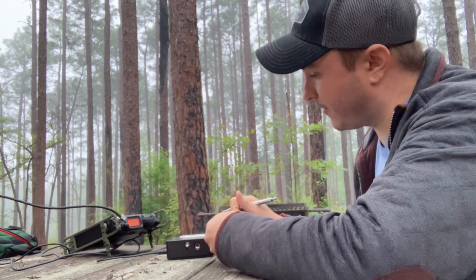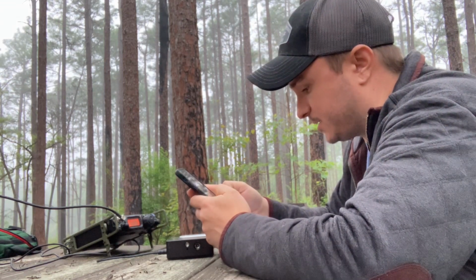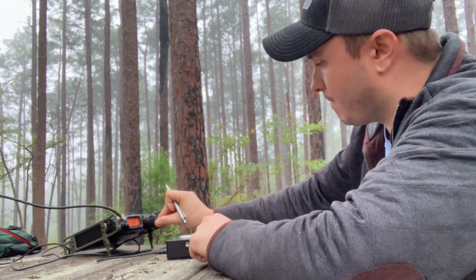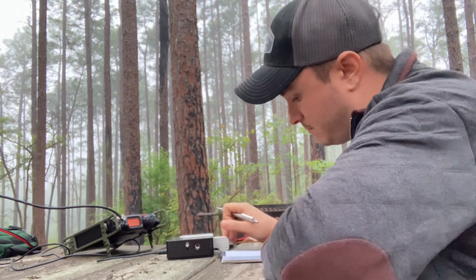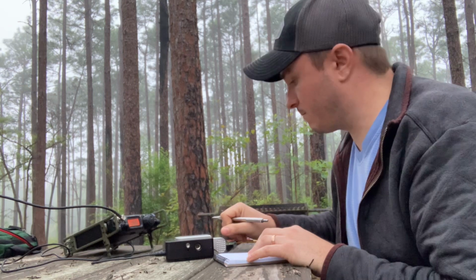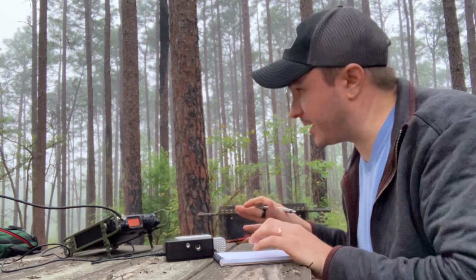All right, I'm on 40 meters, 7.038. I already called QRL once. I'm gonna do it again and jump on the air here in a moment. And I want to move up pretty quick to 20 meters, 17, something like that, to see if I can get a little bit of DX in. So let's try to rack up about 10 contacts or so, maybe a little more on 40, and then move on up. I'm using the MC750. It's the antenna. I think I mentioned that earlier. Set up over yonder.